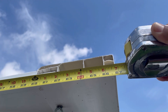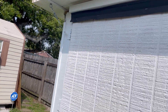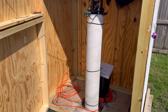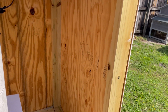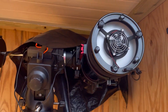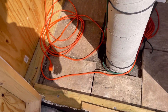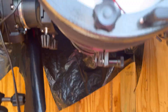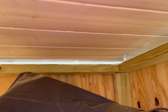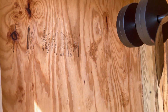For my roof I decided to go 54 and a half inches in length and about 67 inches in width — give or take — whichever dimension you want to look at. Inside, I built a rectangular frame for one side, another rectangular frame for the other side, got some 2x4s, anchored it all down with tap cons, put a support beam up top to connect the left from the right, and used a nail gun to nail the siding in.